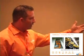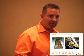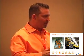So the key is know your length. You have to know your length, yes. Building out a system like a structured cabling environment requires us to do measurement. It's not that difficult once you get into it. You usually put some extra in the loop because you always want to have a service loop. I recommend that you coil things under the floor, so in case you ever have to expand anything, you have that slack in the cable to be able to pull it. But measuring itself, we have the capabilities in house design to be able to assist you with it.